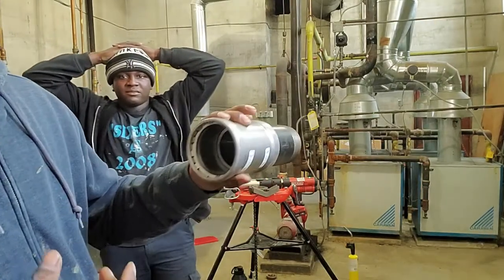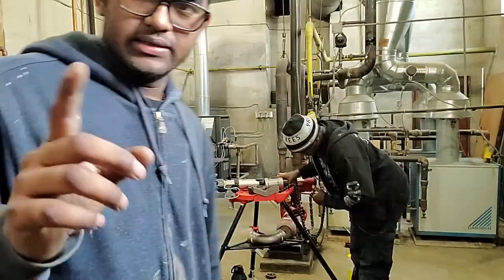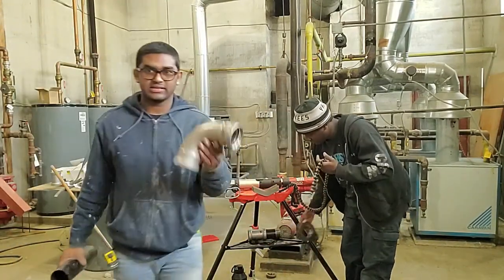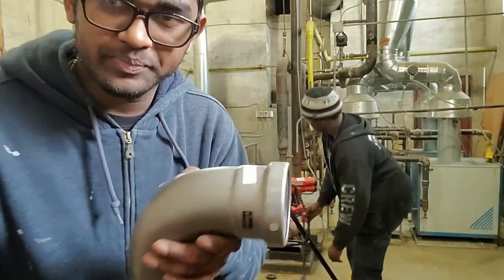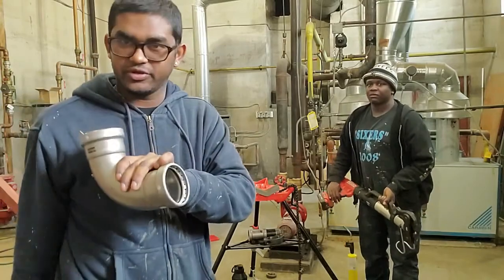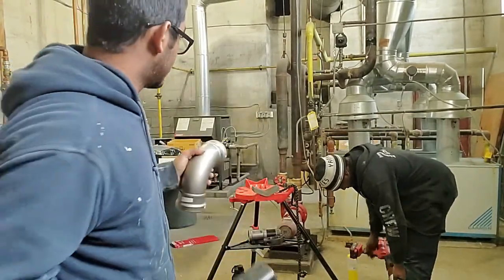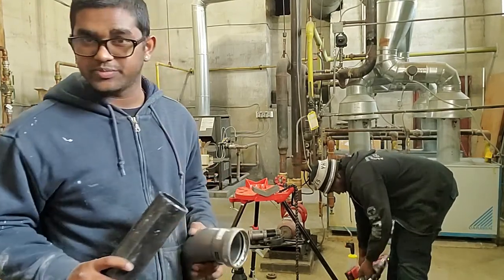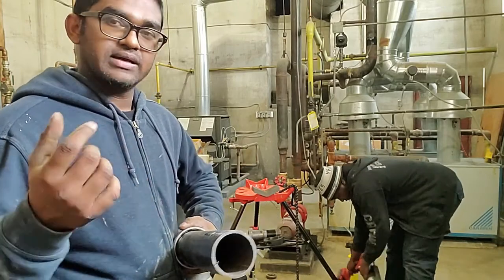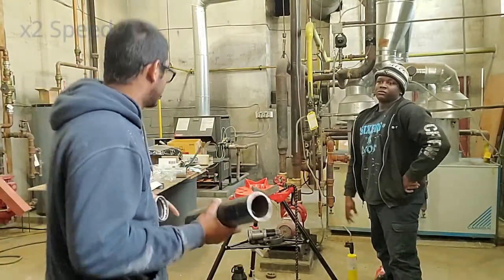So we're gonna add on the rest of the pipe and the assembly that we're gonna do and show you guys. Alright. This is the size of the 90 that we're gonna press on to the thing. So we went in front just now and we got the measurement. We gotta cut a 6-inch piece from this pipe to prefab onto the one that we just pressed, and then assemble it outside. And we're gonna show you what's going on for that as well. So, here we go.